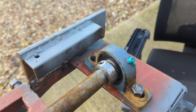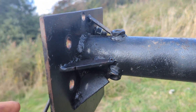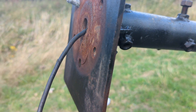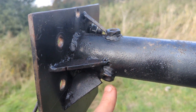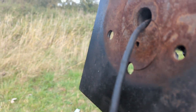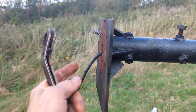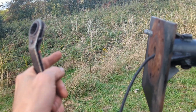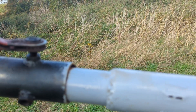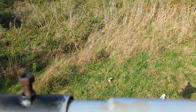There are a couple of things with regards to the tower. This is the top of the tower — this is the thing that I made. I was wondering where this plate was; I thought I'd lost it or chucked it, but it was sitting on top of it. Anyway, I made this to interface with the Chinese wind turbine which had the six holes. What this means is the actual turbine was a foot off here, and I'm saying that because it's extra clearance from the wires. So when we put the new one on, the blades are going to be closer to the wires, and if that's the case this thing will have to get moved down a bit.